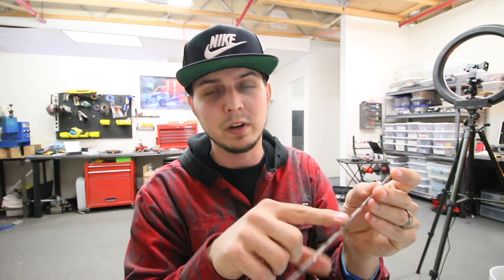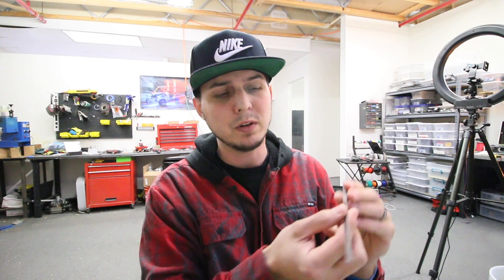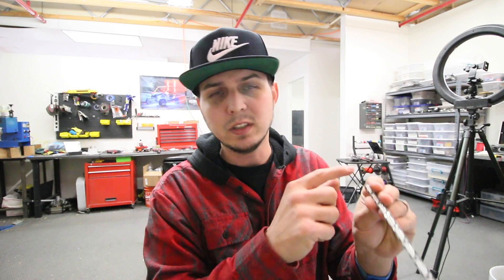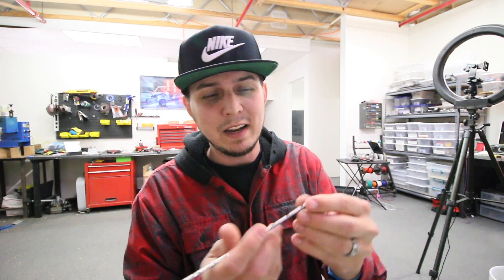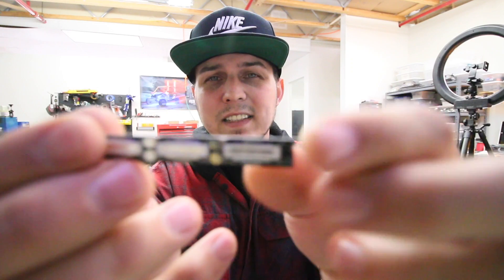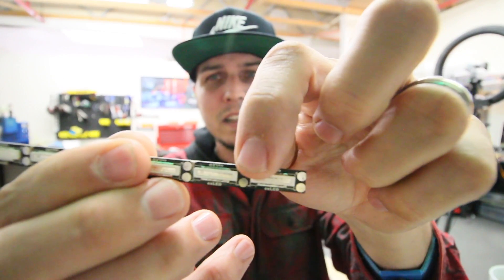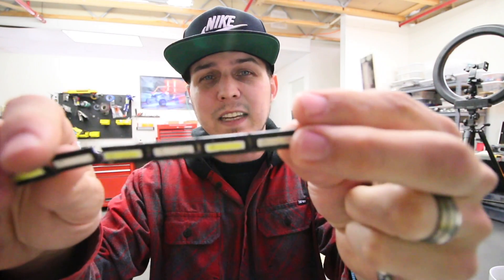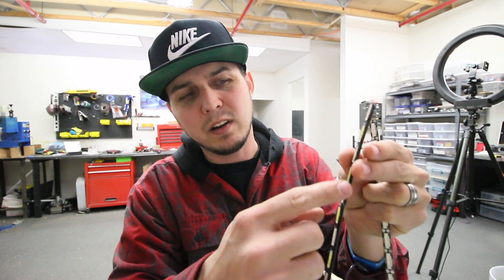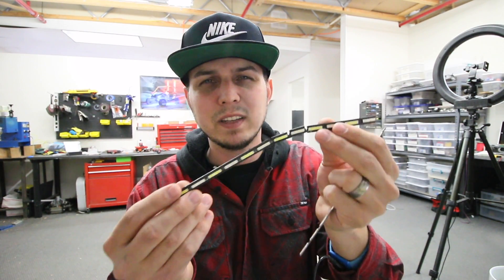What flipping the LEDs 180 degrees means is instead of having a power strip along the front and a ground strip along the front with the whole backside being ground, since I flipped it, the polarity is different. Now I only have one ground strip across the front, the top section is power, and the whole back is power as well. We only have to make one little tiny slit to isolate the ground. One tiny cut with the razor blade versus all this ugly gnarly stuff on the backside, plus running a big ugly wire all the way across the front to connect all the power together - yeah, not a good look.